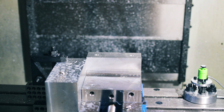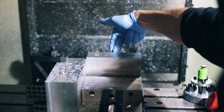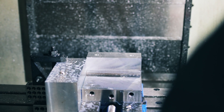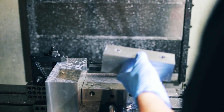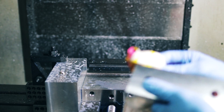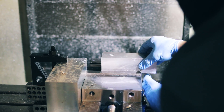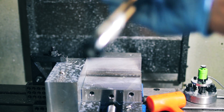Now we've got to change the old flipper holder. What I did is I marked the back edge in the center of this block, because I know the back face of the vise isn't going to move - we hope. So then I flip it and all the other math works out the other way. On one of them though, I rotated it instead of flipping it, and yeah, that kind of screwed that one up a little bit. But I did touch it up. And I'm torquing to 60 foot-pounds.